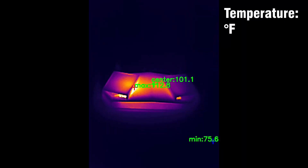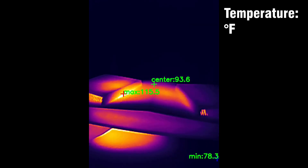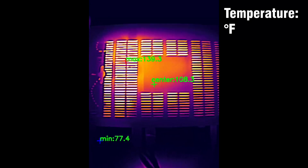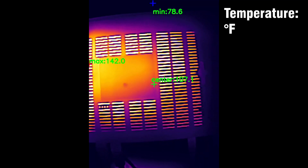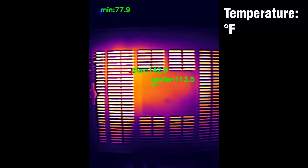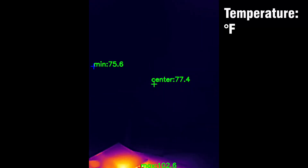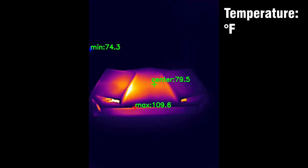As with all other wireless routers and access points I've tested, I need to check how well manufacturers manage to efficiently move heat away from the PCB and chipsets. I used a thermal camera and checked how the BananaPi was doing while running some fairly intense tests. Initially we don't see anything out of the ordinary, but after turning the router upside down, there are some hotter spots. I'm fairly sure this will lead to thermal throttling, because I have already seen some throughput limiting during Wi-Fi tests. The developers should have added some aluminum heat spreaders, or maybe the chipsets are not that energy efficient.